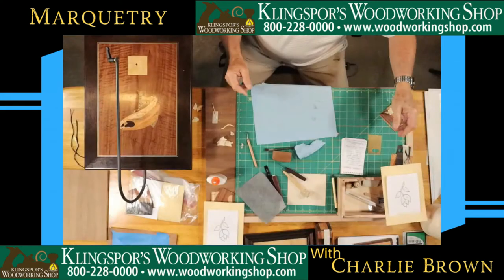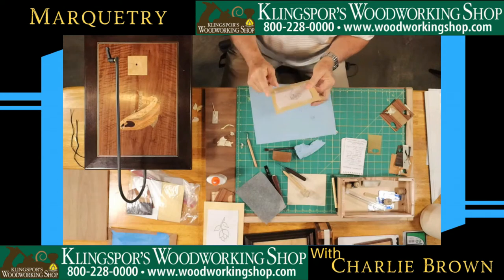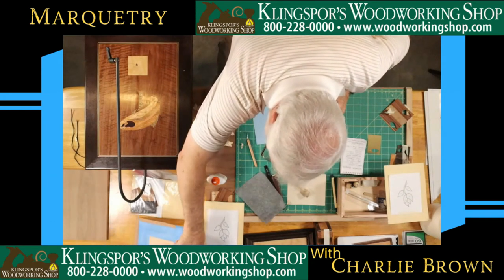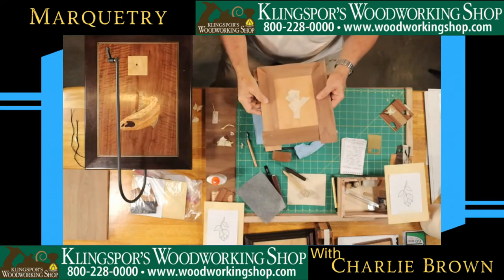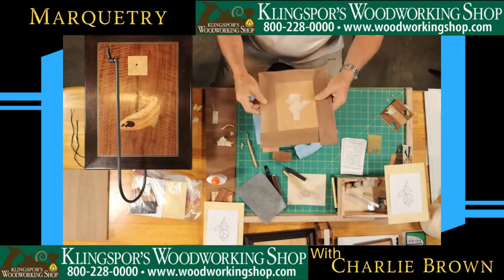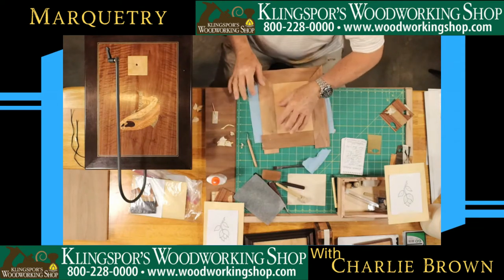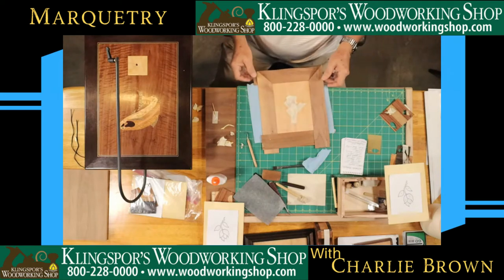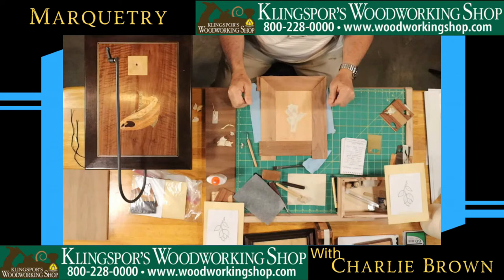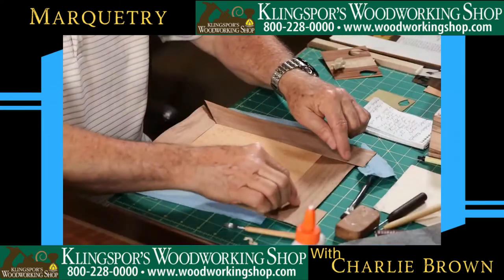To do it with the veneer, you have to square this piece up, this finished piece. You square it up 5x7 with 90-degree corners. That's very important. And then, typically, veneer-type frames are 1.5 inches wide, like on the pictures I showed you earlier. But what you're going to do with that piece after the tape is removed from the back, in this case it hasn't been, but it should have been, you take your strips that have true edges, and you just lay them in a pattern around the finished picture, at least 1.5 inches wide. And typically you cut them 1.75 inches, and then you cut it back to 1.5 inches.